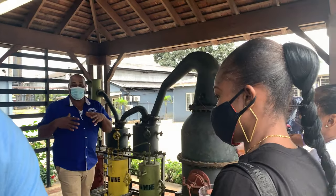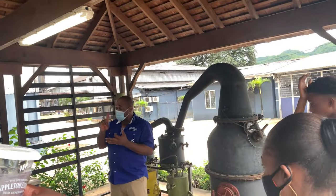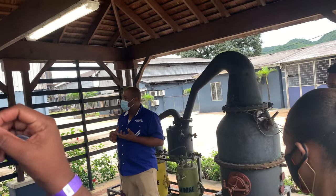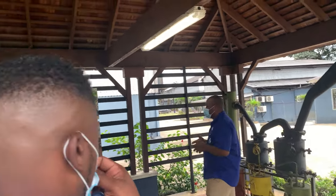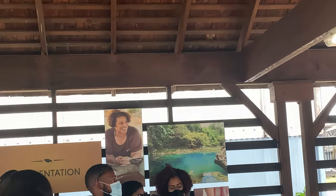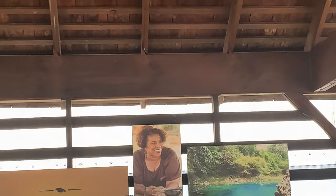And then we add yeast. So the common thing is our three main ingredients: molasses, water, and yeast. And our fermentation will take 2 days, right? So the yeast is really converting the sugars to alcohol at that point, ending up with only 7% alcohol. You know, 2 days fermentation is complete. Perfect. And that wash is called dead wash.